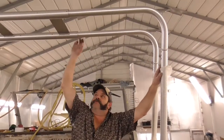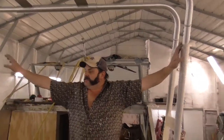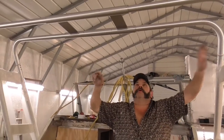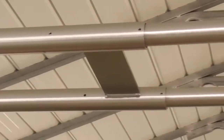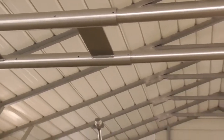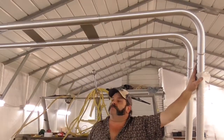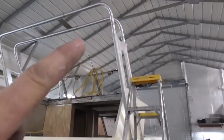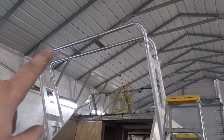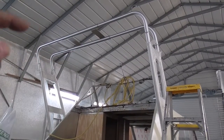We've got the horizontal cross arms in, we've got the radar pad in, and we've got it centered down the center line of the boat. We've taken a couple of measurements at the top and the bottom — we're even, not bowed out at the top. In this position we're perfect to drill these holes and put the cross bolts in to lock these pieces together on either side. Once we get that done and all these bolts tightened up, we'll put the pan in for the radar radome on top. We've also got to put an all-round navigation light up there because that is the tallest part of the boat.